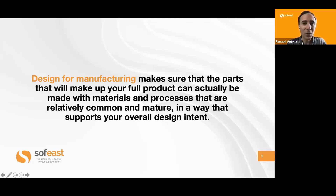Design for manufacturing is one of the most important design elements when it comes to designers. That is where you want to make sure that the design is manufacturable and easy to manufacture, and you want to implement a system of design so that there's only one way for the end user to be able to use the product. During manufacturing, you want to make sure that the assembly of the parts is simplified so that there is basically less possibility of mistakes — they call it mistake-proofing the assembly. That's called design for assembly during manufacturing.